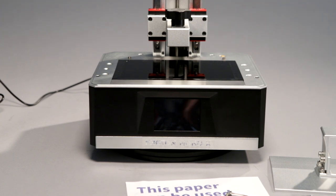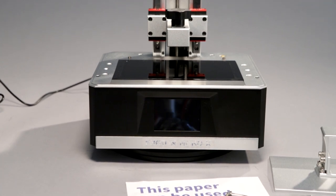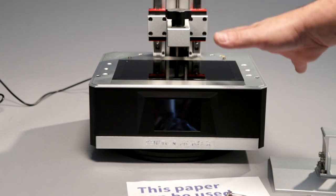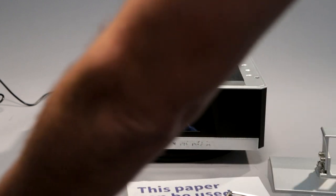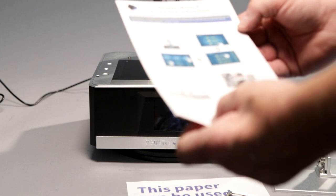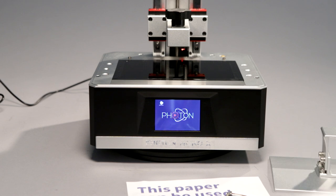So I cleared a spot in the garage, and since I'm set up for the lights I'll show you the bed leveling process — it's pretty straightforward, just like on all other 3D printers. You use a piece of paper for spacing. We're going to follow the instructions: plug it in, remove all accessories, turn on the power switch. We're greeted by the nice Photon logo. Then loosen the four screws on the build platform with the Allen wrench.